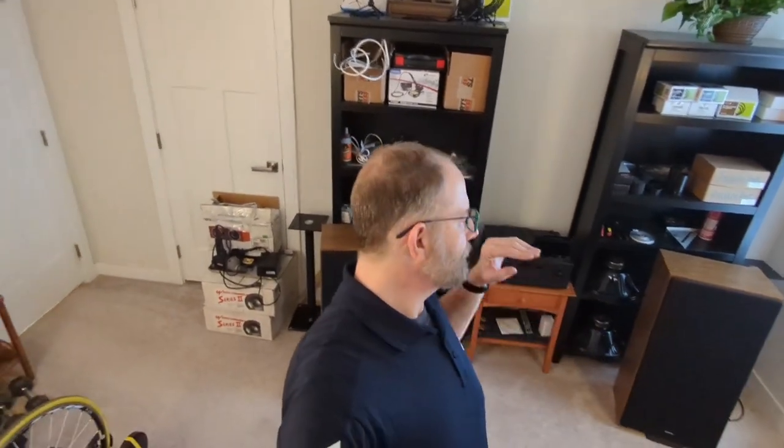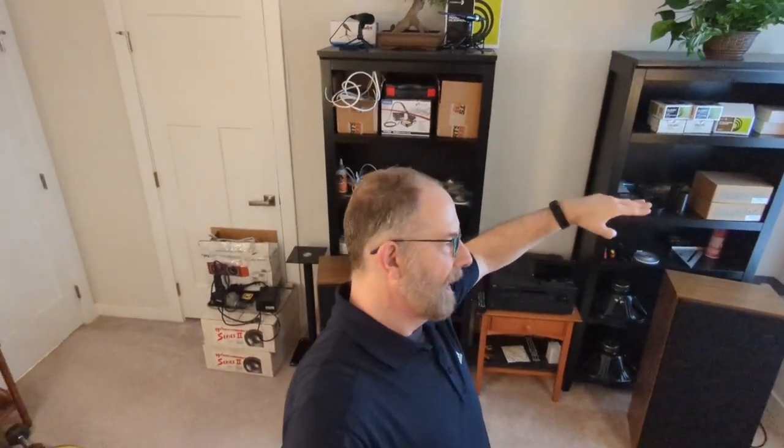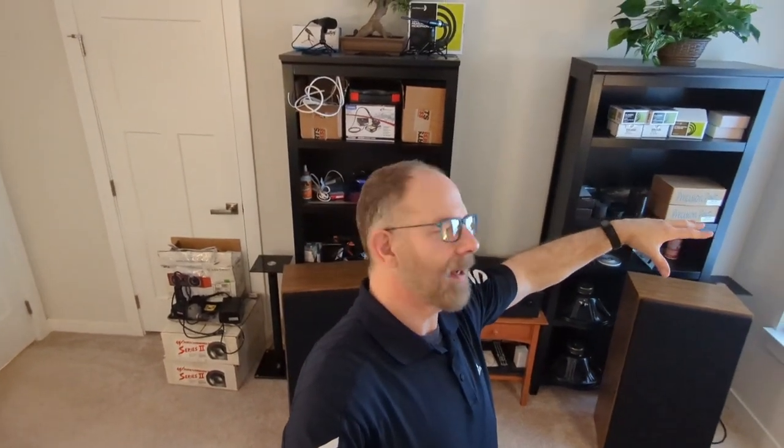But like in my last video, you were seeing that I was trying to put the attenuator on the tweeter and take it back off and measure it. And so I have this issue where the frequency range is okay, and then at the tail end, almost toward the end where you're not going to hear it anymore, it tends to just drop. And there's also a little bit of humps and spikes in the mid-range area. They're not super annoying or anything, but I'd like to get it smoother if I could. So today I think the first thing I'll do is experiment a little bit with that Zobel network that I put on there, as well as the 2-ohm resistor for the attenuator, and try to figure out exactly what's happening and if I can make some changes and get that frequency response a little bit better on the top end.